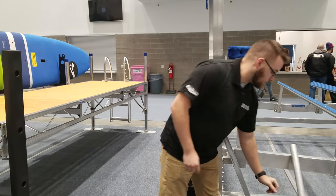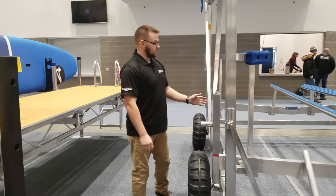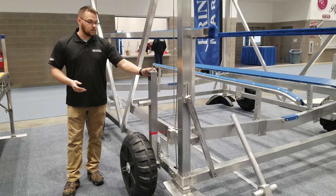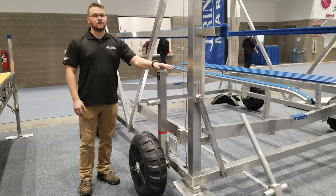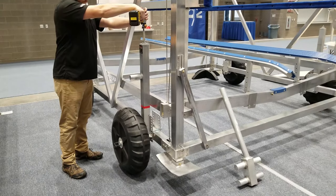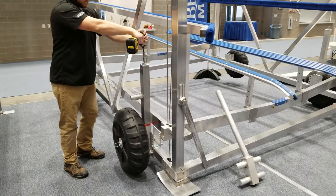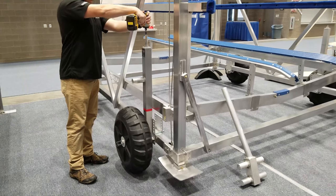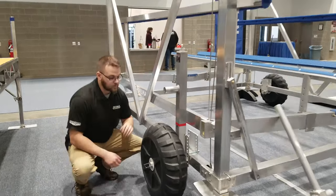We do carry these in stock and have them available at the shop. Moving on, we have our smart jack, which just like our dock wheel legs is a screw leg system. If you stick a 9/16 wrench, socket, or impact over the top of this, you can just screw it up or down. You can roll it out, get it into place where you want it, drop the leg of the hoist, and then just screw the wheel up. We also recommend that you take the wheel off when it's not in use.